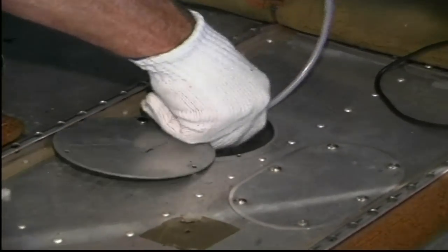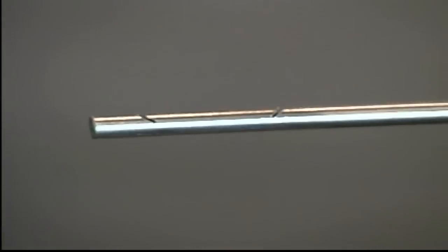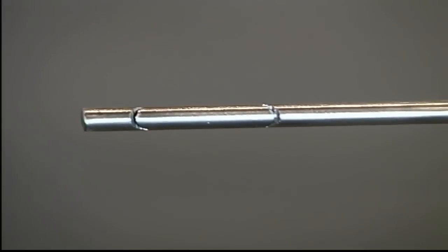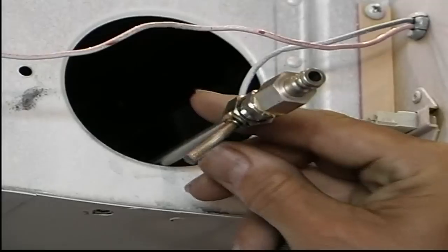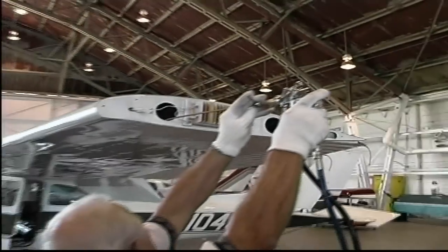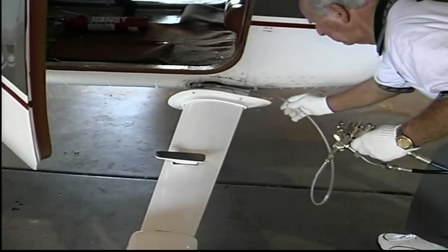Determining which wand or nozzle to use will depend on finding the optimum balance between convenience and effectiveness. Note that each stainless wand has one or two kerfs or notches at the point end. These kerfs are aligned with the reference pin located on the opposite end of the wand and provide a 180-degree angled spray pattern. They also have a directional pin that enables the operator to determine the direction of the fogging spray inside a structure and to change the fog direction when desired. The flexible wands provide different spray patterns that will help to access enclosed structures on various airframe configurations.